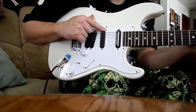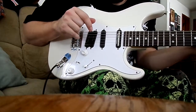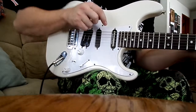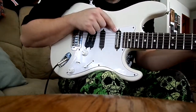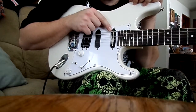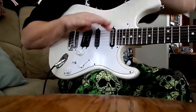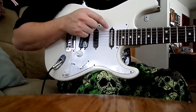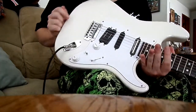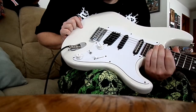So it's a true single coil, so it's got a lot of hum, and everything you touch is very microphonic there. And then a Seymour Duncan double stack mini humbucker. What they did is they stacked the coils on top of each other and put a single bar. Pretty good, clean pickup. Distorted, it's not really as hot as you think it would be.